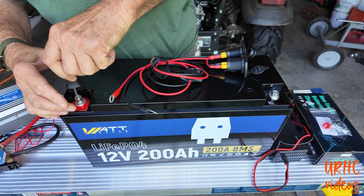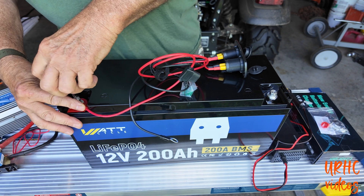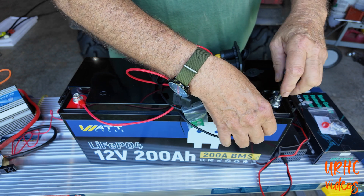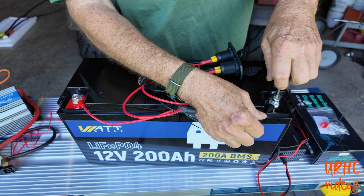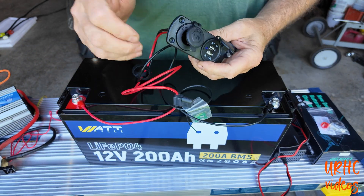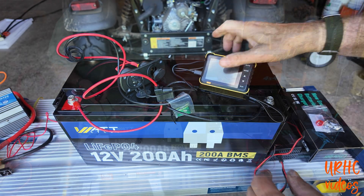For a lot of uses I'm going to use it as a 12-volt battery for running things that plug into cigarette lighters and recharging cell phones and other items that charge through USB. This little assembly I bought off Amazon came with all the lugs on and I'm just going to mount it to the plus and minus terminals. It does have a fuse and everything, so it's a good way to get a cigarette lighter plug on this battery. The voltage is a little higher than a lead-acid battery, so make sure everything you run is tolerant of the higher voltage. I'm going to charge my little oscilloscope here via USB to test it out.